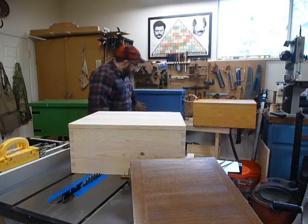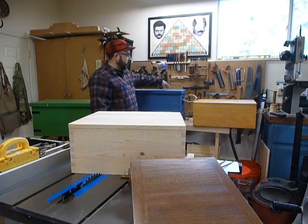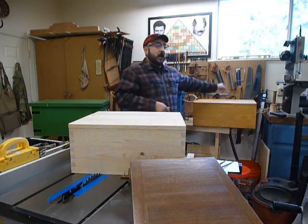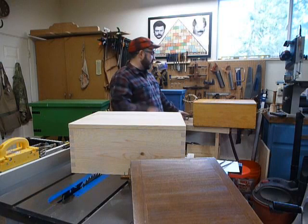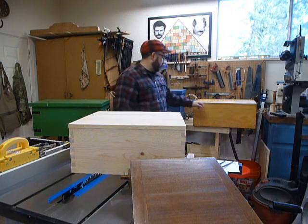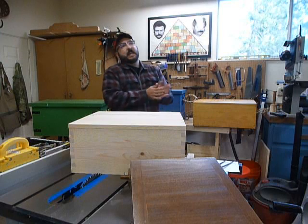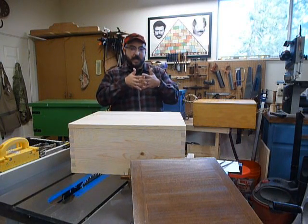This trunk has no fasteners holding the body together — all hand-cut dovetails. The top is tongue-and-groove with breadboard ends and a hand-cut dovetail dust skirt. So this is bulletproof. Where are you going to see shortcuts in construction? Essentially Civil War garbage. Hardtack boxes are all nailed with cut nails, not wire nails; the bottoms and tops are also nailed on. Ammo boxes you'll see with roughly one-and-an-eighth to one-and-a-quarter inch box joints, and those box joints are nailed for additional strength. Both of those items were garbage pieces.